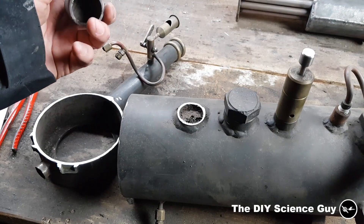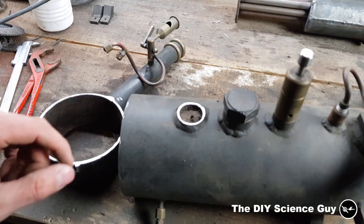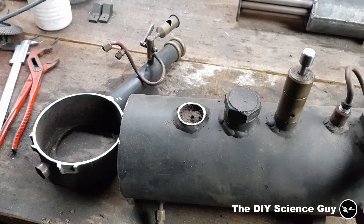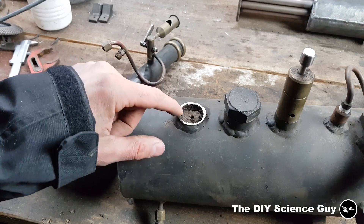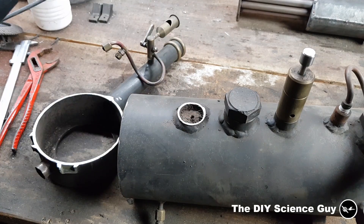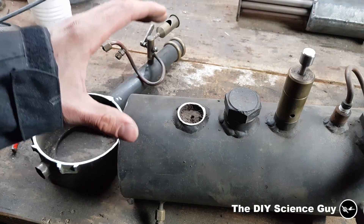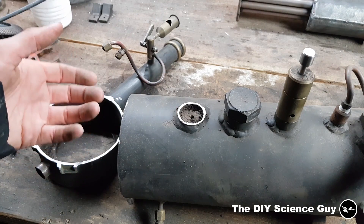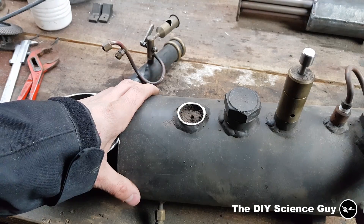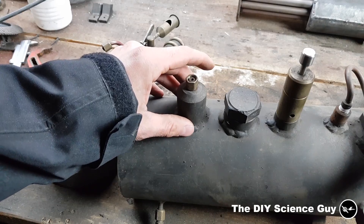So as you can see I also cut off the steam dome. That's because the hole I drilled back when I was 16 years old — I didn't really know how this worked. So I just drilled a little hole and thought the steam would expand in here and then go to the steam engine. But the problem is that water will boil in here, and that whole water pocket will be pushed into the hose that goes to the steam engine. That's not really a problem if you're stationary, but when I had it on a boat in the waves, rocking back and forth, the water in the boiler was also moving, and therefore water was pushed into this hole into the dome, so the dome didn't work at all. I'm now going to make this hole a little bit bigger so that problem won't occur anymore, and then I will weld this back on.